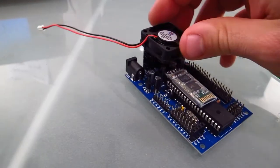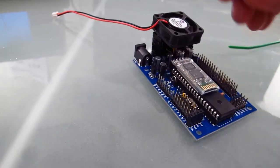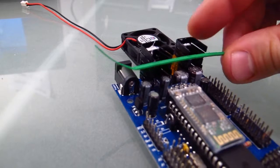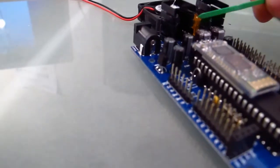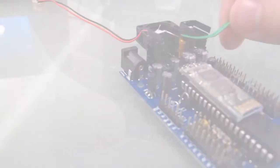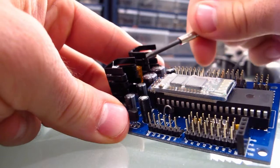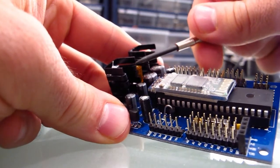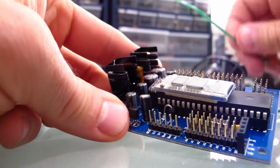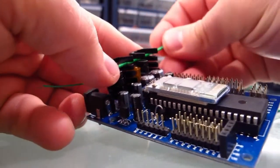We're going to want the fan to sit on top of the heat sinks like this, and I would use a twist tie through these little grooves here to hold it in place. Now the grooves are going to be a little too small at first, so you're not going to be able to fit your twist tie all the way across. What I've had to do is take a little flat-head screwdriver and pry them up just a tiny bit — that should give you enough room to slide your zip tie right in there.